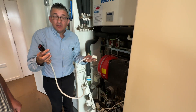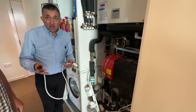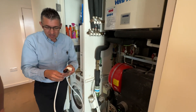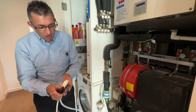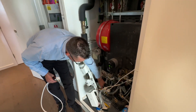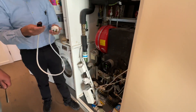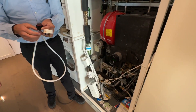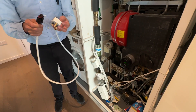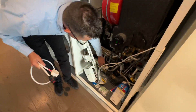EON won't like this — they only want you to call them, they don't want to know about anything else, which is totally unsatisfactory. But if you're not getting any joy with EON and you've got kids at home and you're freezing cold, plug this in and it will make the whole house work. It's like a kettle lead — or more like a PC lead — connected to the mains. It bypasses all of the valves and simply drives the pump, letting the heat come in. You have to have the valves off, because if the actuators are on the thermostats will be stopping flow. It's an emergency lead for the winter — about ten quid online, and I can make it available via the concierge.